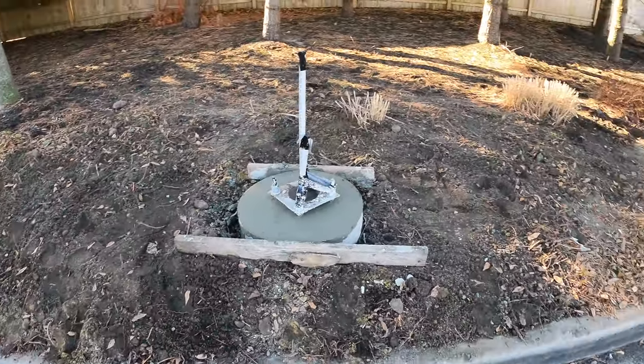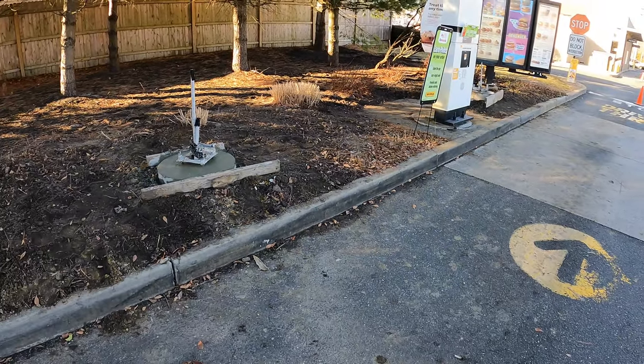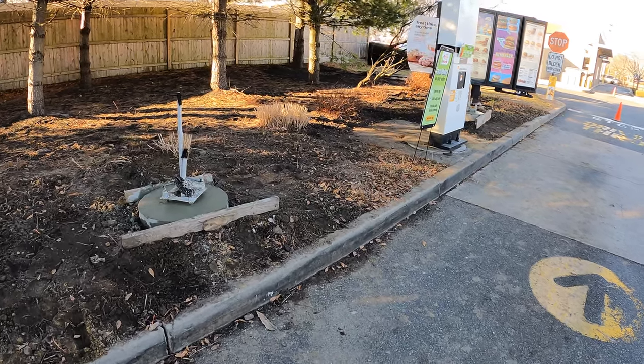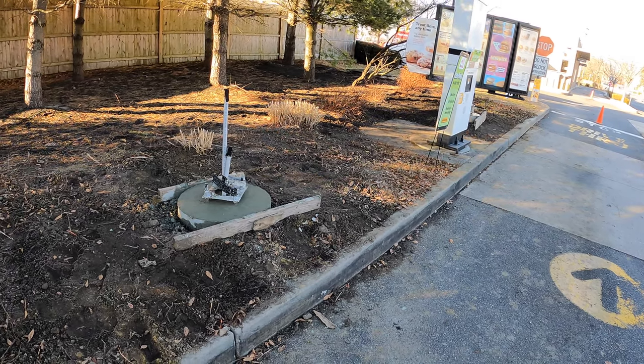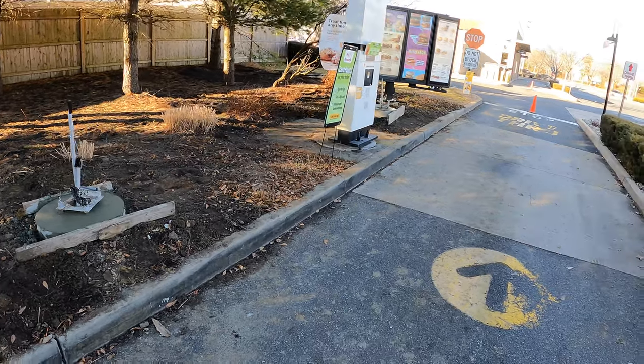If I was doing a slab, I don't do a lot of slab work, but if I was doing a slab, I might have rejected it because it was really watery coming out, and it's taking forever to get to this point. We probably got another hour before we could really trowel it off and get it to what we want it to look like.